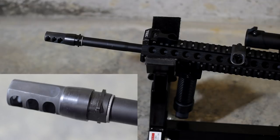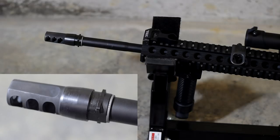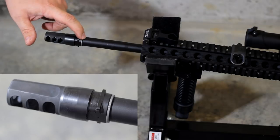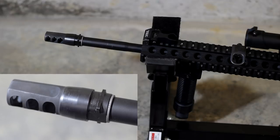The only thing I can say bad about the Accu Washer system is that it comes in gray — you can't get them in black. I talked to the company and they said in order to make them black, because it's such a precision process that they use to make these, you would actually have to be paying upwards of $50 a pack. I think the $25 price is right where it needs to be. So if you don't like the silver look, you can just take some flat black paint and paint the outside. You do not want to paint anything on the inside surfaces — that will cause your degrees to be off. It's a very precision process that they use in their machining, so do not put anything on the sides of your Accu Washer.